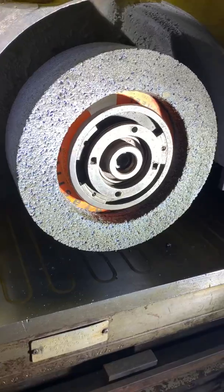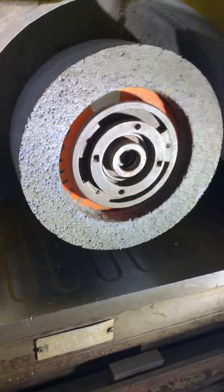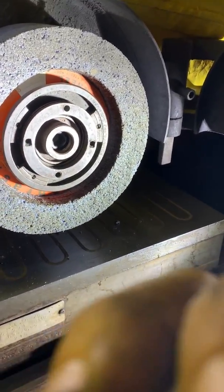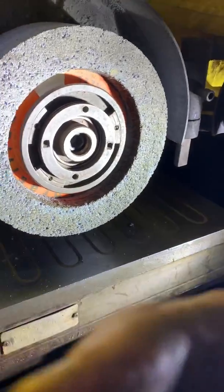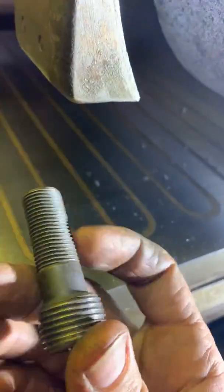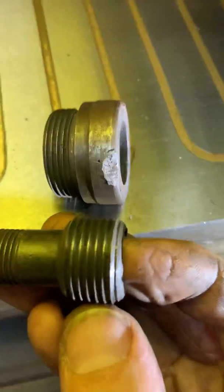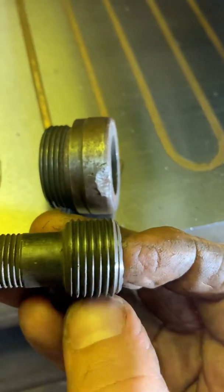Good morning guys. What we're doing today involves this Blom surface grinder - it's a Simplex 75, but I'm 99% sure they're all the same. Removing the grinding hub from the spindle is different to most. How this locks is a differential screw: a 1.5 thread runs into the spindle, a 2.0 thread goes into the bush, and this side of the bolt is a 2.0 thread as well. It's a little bit tricky if you get the sequence wrong.